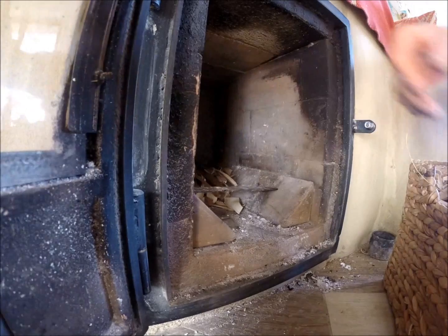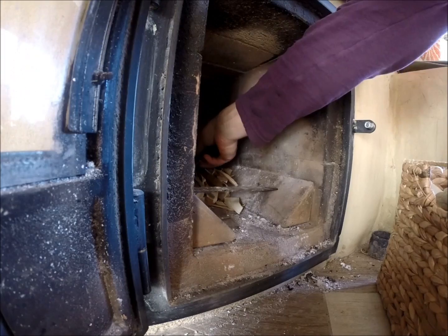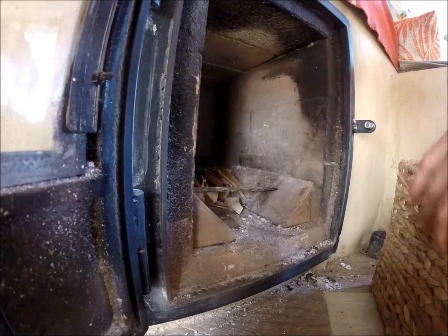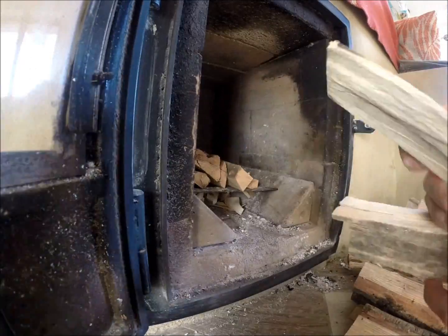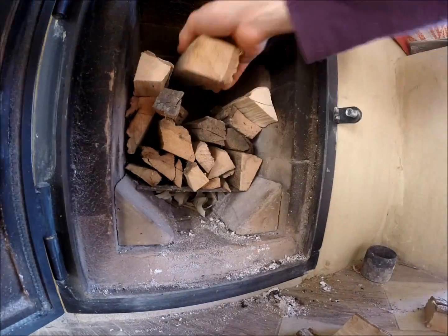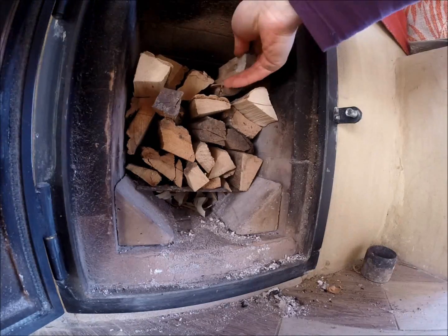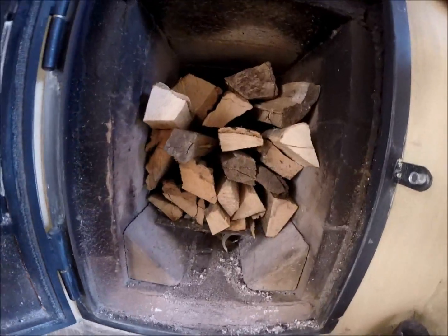I take care not to overdo the shavings. There must be plenty of corridors for the gases to pass through the shavings to the port; otherwise the air and gases will take an alternative route above the fuel, and that's not a good option. I filled the bench box almost to the top. Doors closed, and this is it. You should know that my bench box is not a perfect system because I added a slightly too large bench to it, but I fine-tuned it with some additions and now it works reliably.